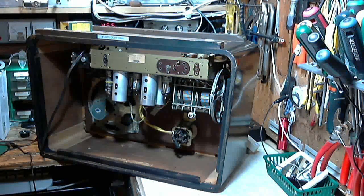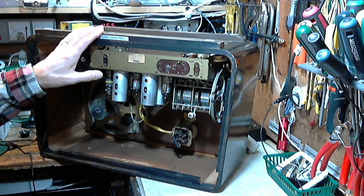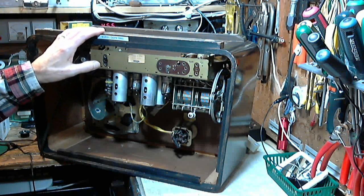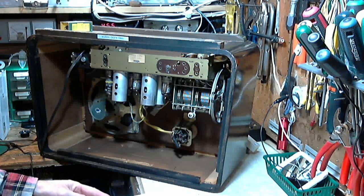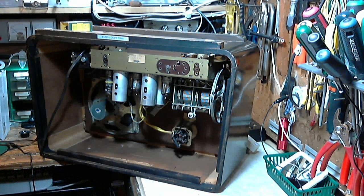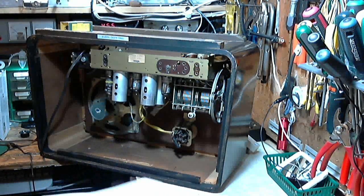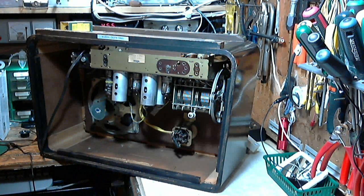Welcome back to my shop. I'm going to carry on with this Grundig 238W UKW radio. It's largely working, but FM is distorted - and that's been the way it's been the whole time with this radio. If you watched my last videos, you'll know I've done a somewhat Herculean effort at tuning the distortion out by trying different alignment things, and I got nowhere doing that.